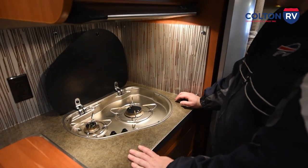One thing I like to say: because you have a propane generator, if you refill your propane after running out and your generator's not starting, lighting your stove is a good way to prime the system with propane. Every time you fill it up, light your stove and make sure you have propane in all the lines so your generator will start.